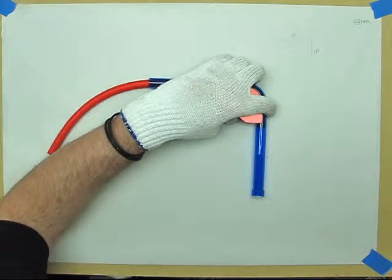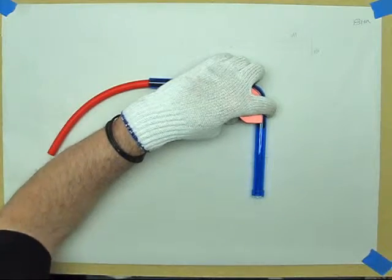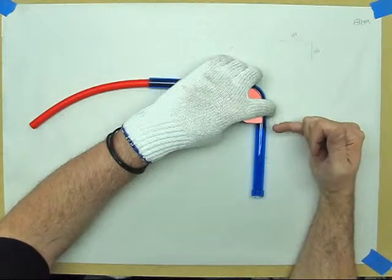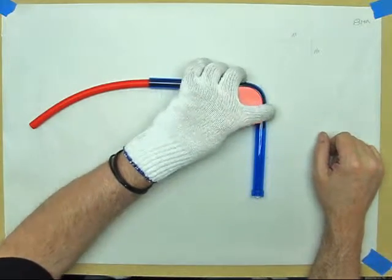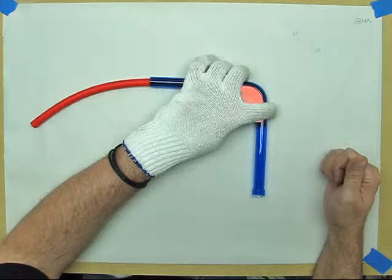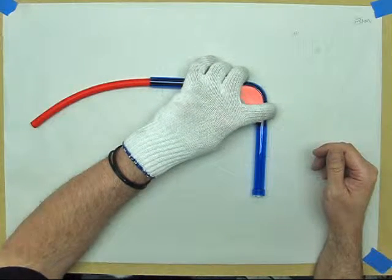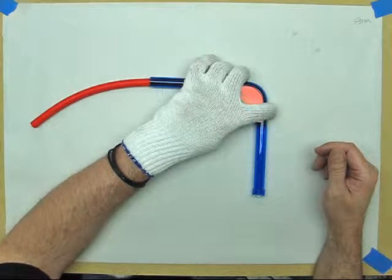I don't know if it shows up in the video, but one of the things I did was I ran the silicone insert rod to about 1/4 inch past the outfeed arm of the mandrel, and that gave me an idea of where to actually heat. Because when you are sitting there holding your tube and your heat gun, it gets a little confusing about where you actually need to heat. Again, we cover the actual tube bending in the heat gun kit video.